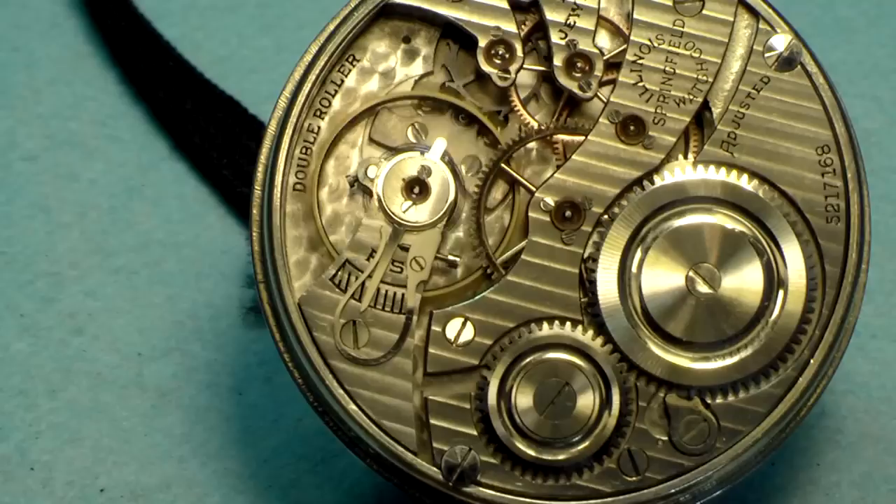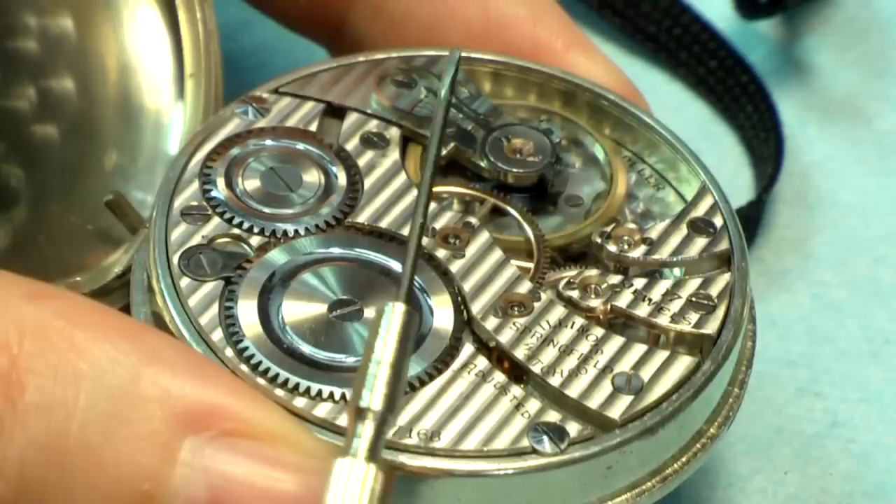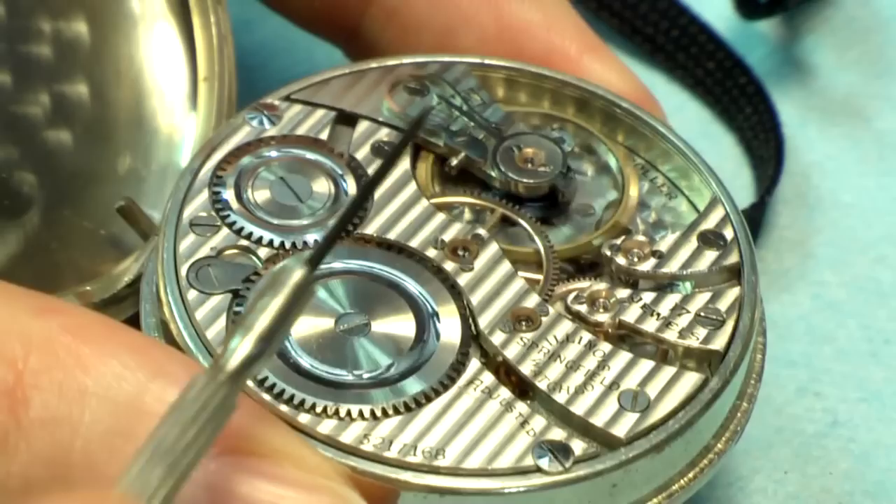You want to do it in very small increments, and then you want to wait a while for the watch to settle in and see what the time is like over the course of a day or two before you would go and make any other change. The worst thing you can do is try to make a really big adjustment and set the watch so far out of whack that you don't have any reference point for making an adjustment later on. To actually set this screw, you need an extremely fine screwdriver — I've actually modified this screwdriver to be even finer. You really need a razor edge on this blade to be able to get into the very small slot to adjust the screw.